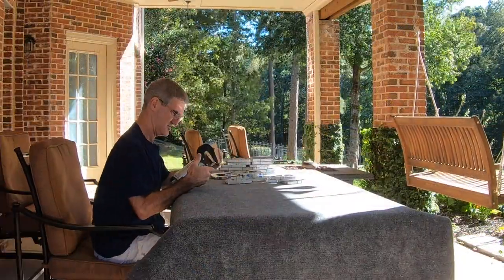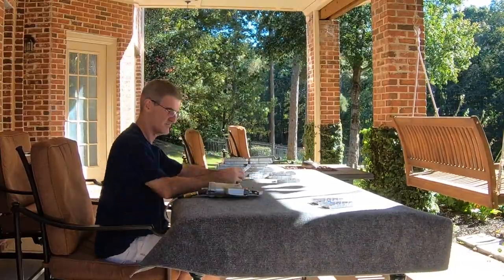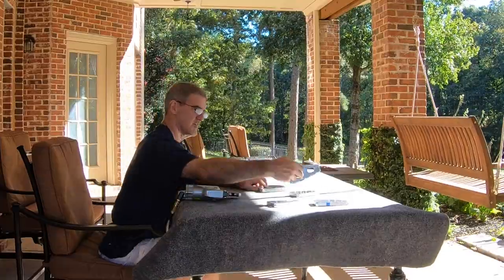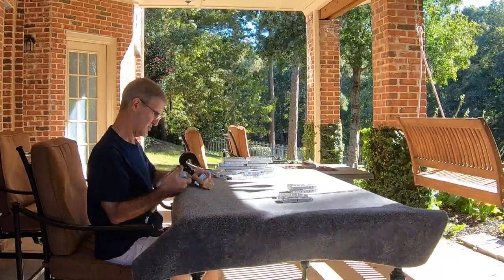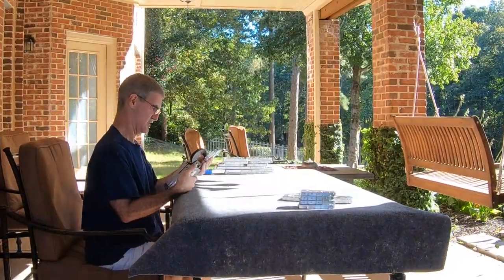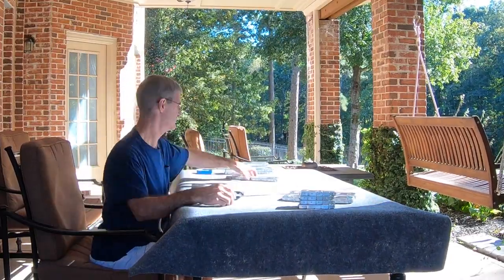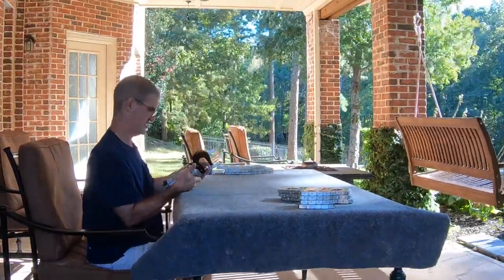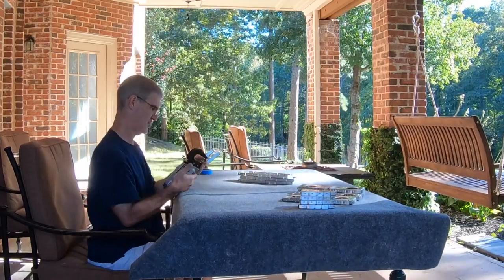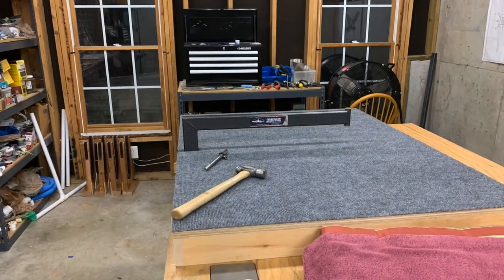The substructure dies — from everything I've read, you don't really need them; you can use the same dies on the substructure that you use on the skin. The substructure dies are at a slightly different angle and make a dimple better angled to accept another dimple as opposed to the head of a flush rivet. But the real reason I like them is that the female half of the die is a smaller diameter, so it doesn't interfere with the web of a rib when you're dimpling the flange. That wraps up all the dimpling — thanks for watching.